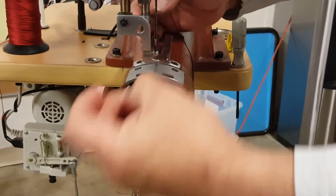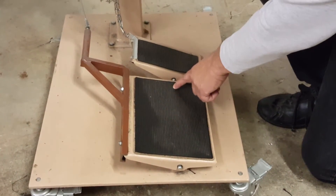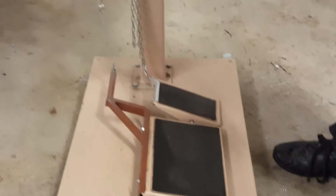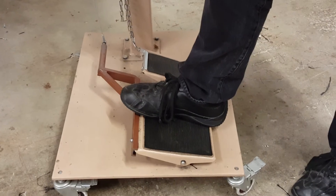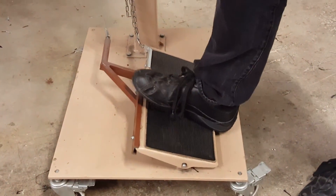So let's do it from the pedal side. Down here, this is a typical sewing machine pedal, and there's an axle just below the center line of the pedal. When you put your foot on here, the toe is up here and the heel is down here. If you push with your toe and tap it with my toe, the needle is at the bottom dead center. Now the same with my heel — with my foot in the normal operator's position, I'm going to use my heel, and it stops the needle in the top dead center.